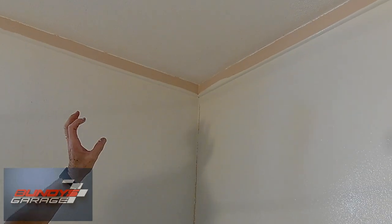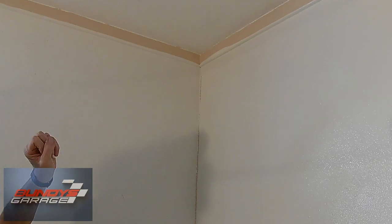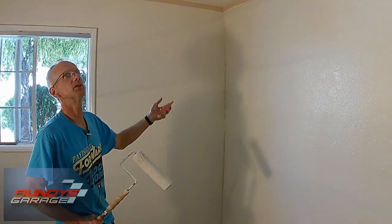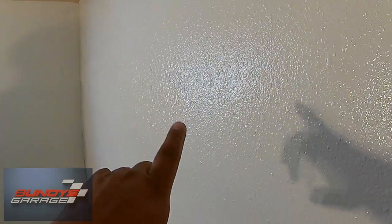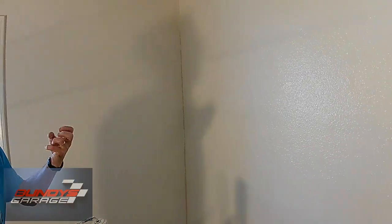You're using a flat ceiling finish paint — different paint. Even if it's the exact same color white, you're going to use a flat ceiling paint. The higher the sheen, the more it's going to reflect the light. So when you have a ceiling, it's pretty standard to just paint that flat. You can see on the middle wall there's not a whole lot of imperfections — the higher the sheen, the more imperfections you're going to see because it reflects the light better. With flat paint, it does not reflect the light as much and you won't see as many imperfections.